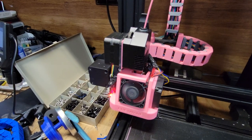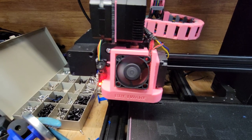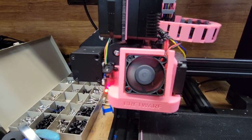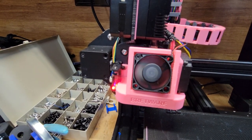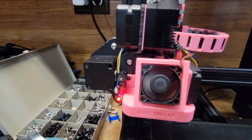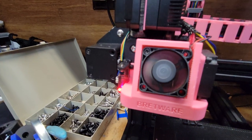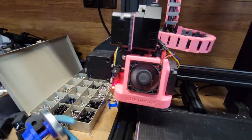This is a magic bullet for these printers if there ever was one. If you wrap the heat block and have a regular fan cover with good airflow, I don't see why it won't work perfectly. One more rule: don't use one of those so-called silent fans that run at about half the amperage — you never want to drop your amps on a fan because that's what fights your static pressure. Drop your amps and you lose all your static. Good luck, everybody.